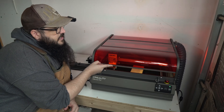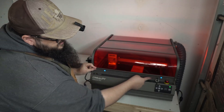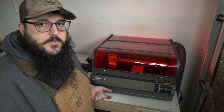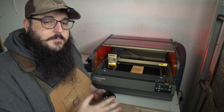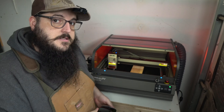The sliding door has a safety feature where it'll turn off the laser if you open it mid-cut. The two lights here will change colors when you open the door. Now this doesn't look very good for filming, but you can actually use magnets to fool it into thinking the door is closed. I don't recommend doing that, but if you need to film something, make sure you have safety glasses nearby to use instead.